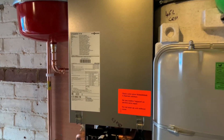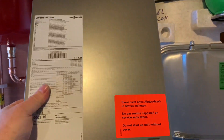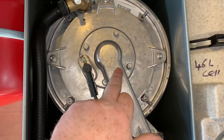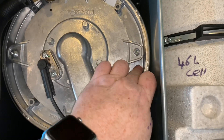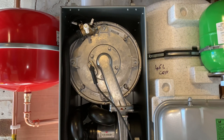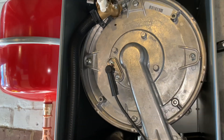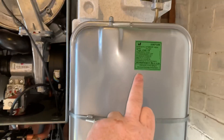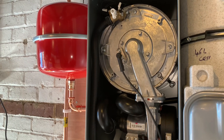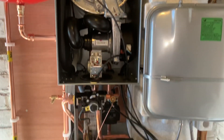If we have a look inside the heat engine area — the heat exchanger — I'll take these clips off the bottom and the cover just lifts off. Inside the boiler we can see the Viessmann stainless steel heat exchanger. This is the burner area, and the heat exchanger is one single coil all the way around — about a 22mm pipe going all the way around as one continuous coil. In this model we've got rubber hoses. I've been informed by Viessmann that if the pressures are right and you keep your expansion vessel charged, you're never going to have an issue with the hoses. Personally I'm not a lover of the hoses, but I did go to one that was ten years old with no issues at all, so I think it depends on the installation.